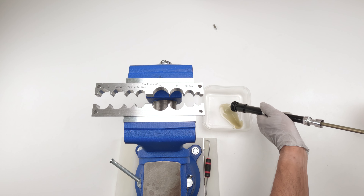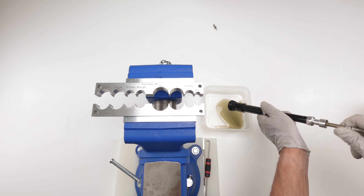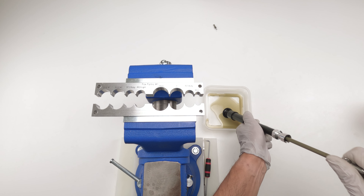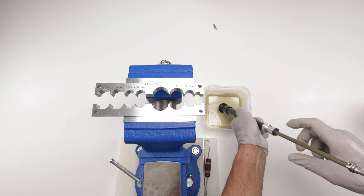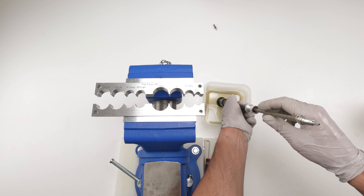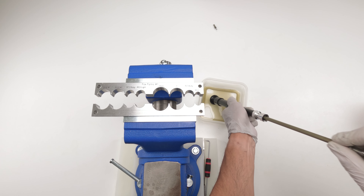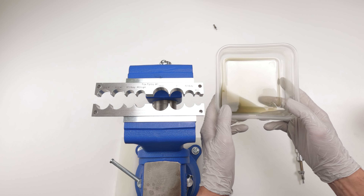Now I'm going to empty out the oil from the inside — that is nasty, nasty stuff. It should be a really translucent color. This has definitely been a while since it was serviced, and I'm pretty sure it wasn't serviced when it was supposed to be. There's a good amount of play in the shaft — so that assembly is worn out, at least the bushing in there.